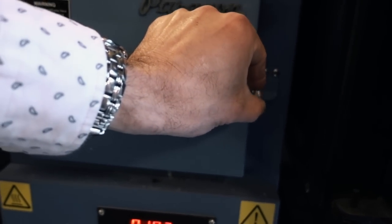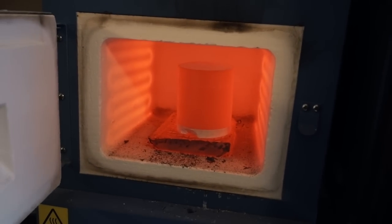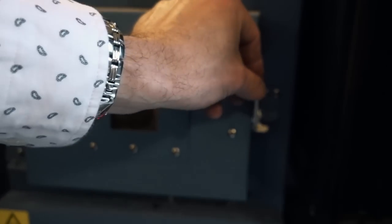Absolutely red hot, very very hot. It's too hot to cast at that temperature. The flask has to stay at that temperature for another hour and six minutes, then it's going to come back down to around 400 degrees, held at that temperature for a couple of hours because the core has to come down to that temperature as well. The outside may be 400 degrees but if the inside is hotter you're not going to get a successful cast.